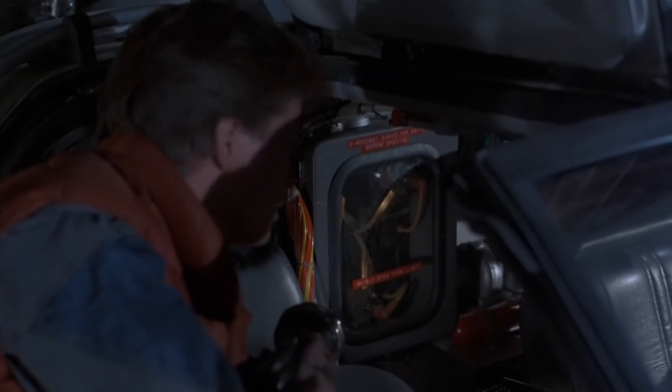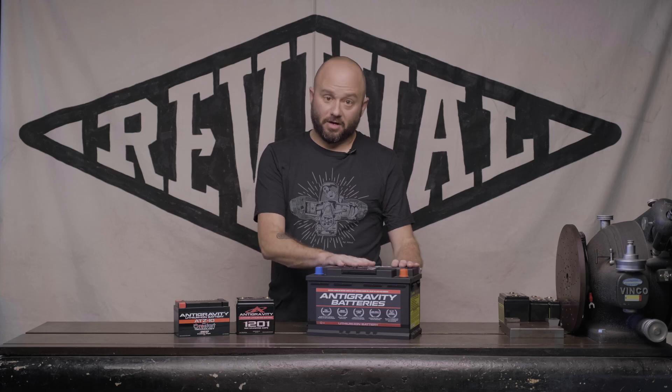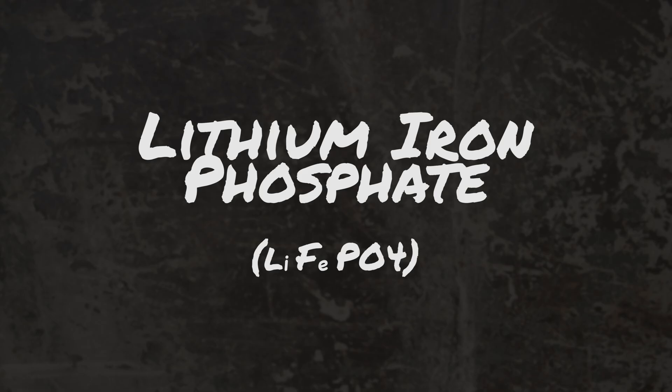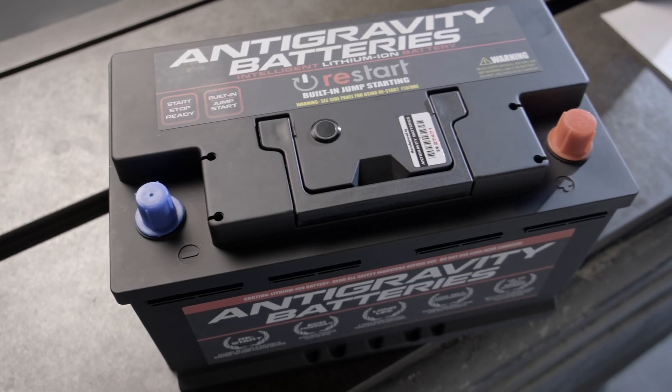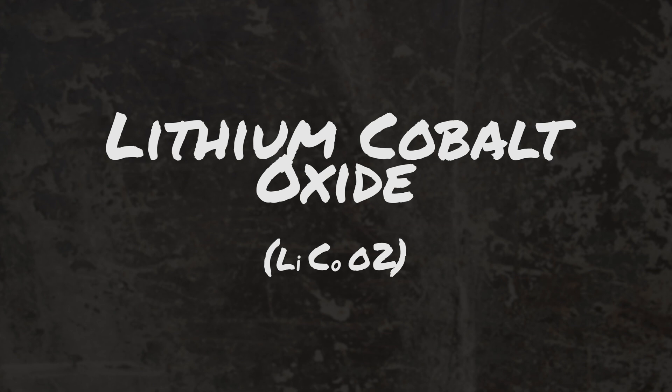You're asking how the hell does that work — is it a box of miracles? Lithium iron phosphate, or LiFePO4, is what these are made from. They're much more stable, much more hardy, and will put up with a lot more abuse. Lithium cobalt oxide batteries are the ones that are unstable — those are the ones you hear about blowing up in airplanes, in cell phones, computers and catching fire.